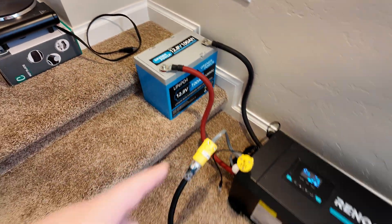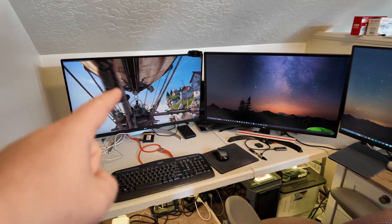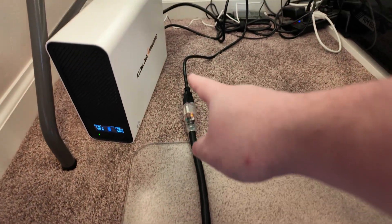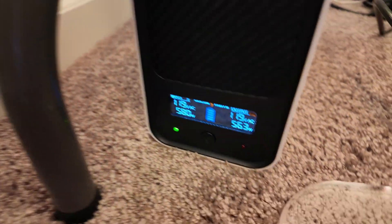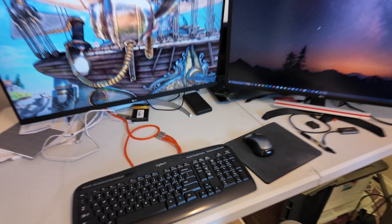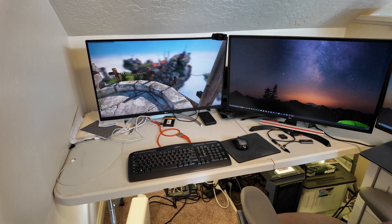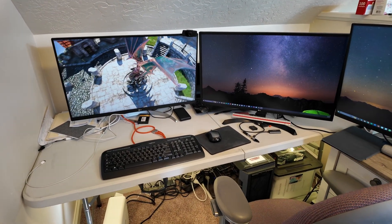Can this Greener Power 12 volt battery run a high-end desktop gaming PC workstation? I've got three 4K monitors here and a 4K gaming benchmark running. There's no power plugged in from the grid — the cord comes into this lithium iron phosphate UPS unit from GoldenMate. The computer is pulling just under 600 watts of power. Pushing this PC to its max, that 12 volt battery will run it for approximately two hours if fully charged. If you're doing basic word processing, email, or web browsing, you could easily get four to six hours.